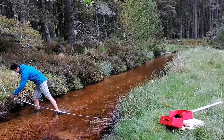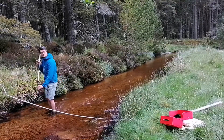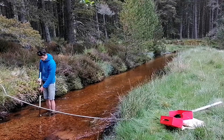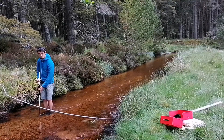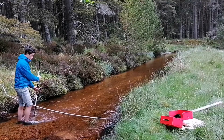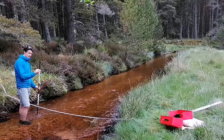86 centimeters from the left-hand bank is here, then placing the propeller into the flow. Something about where you're standing: if you're standing behind, you might be causing a bit of blockage for the velocity. Especially if you're standing upstream of the impeller, you are causing huge implications for the velocity. So you want to be stood away.